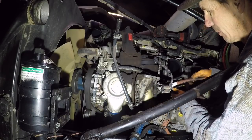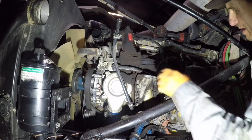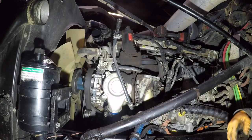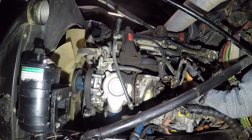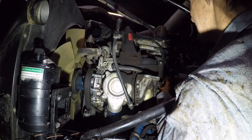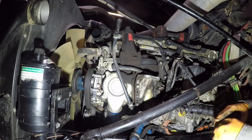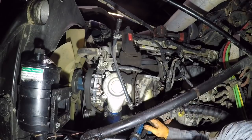So I welded a couple jobs with that LN25, and I only used it a couple times, and I basically forgot how to hook it up. Then I started messing with these sprockets again, and on this welder here, it has an actual setting for flux core. You can either run solid wire or flux core. So I went over to flux. It actually has two different wire feed settings on this Trailblazer 325. It's got a flux core for constant current, and then a flux core for constant voltage, which is what I'm running, voltage sensing.